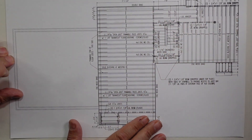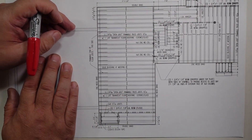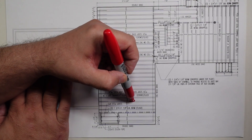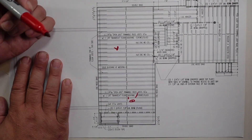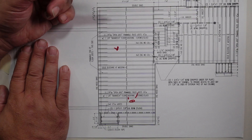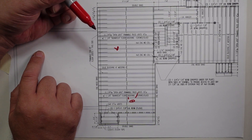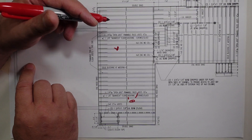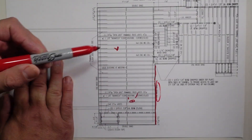You can see here I took a partial section of the floor framing — there's a whole other section of the house. In an effort to draw it up to scale for you, I took one section. If you remember in the video out at the job site, I was probably standing right about there with the camera looking here, to give you a sense of where I was in that layout. So trimmable floor joists — we talked about those in a few of the earlier videos. Go check them out where we show pictures and talk about why we would use them, what the basic pros and cons are. Here in the floor framing plan, you can see the information we lay out.